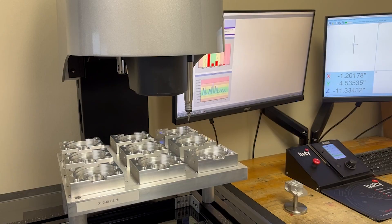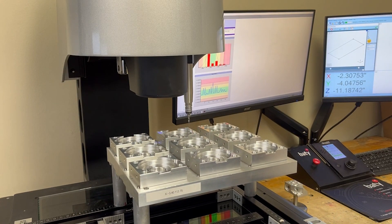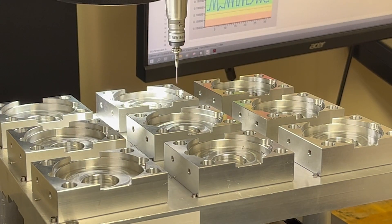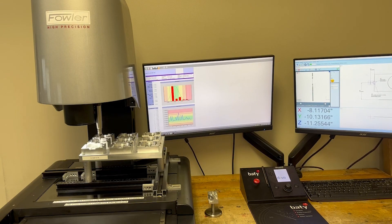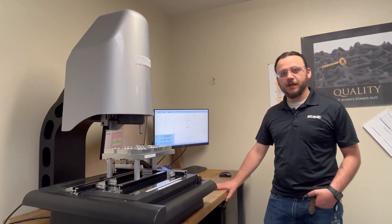This is capable of conducting measurements both with a touch probe and with a high-zoom camera. We run it lights out many days with multi-piece fixtures, and the software is capable of exporting both full inspection data and individual feature SPC into our ERP business management system.